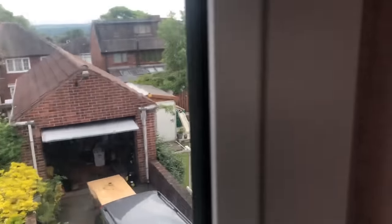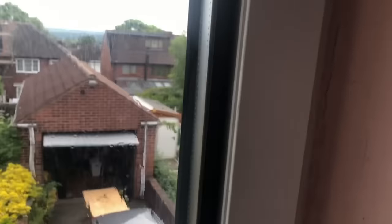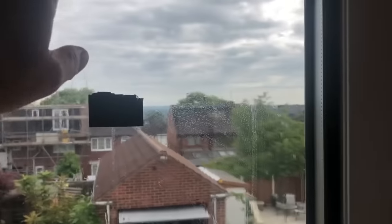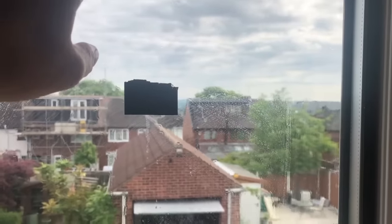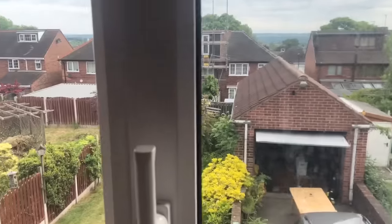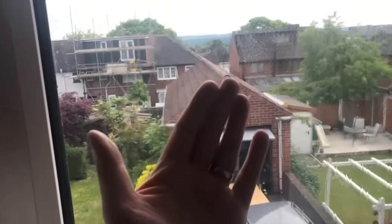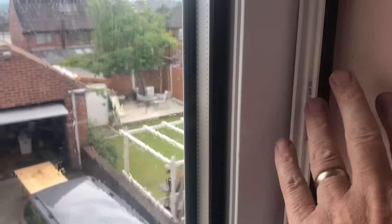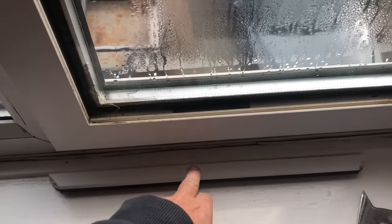So that's one side down, three to go. I'm going to remove the larger lengths first, then probably the bottom, then the top — that way the glass doesn't surprise you as it folds in. We've now removed all of the beading: the right edge, the top, and the bottom.